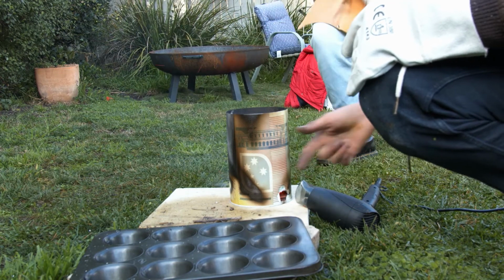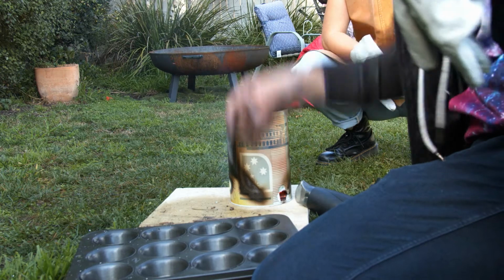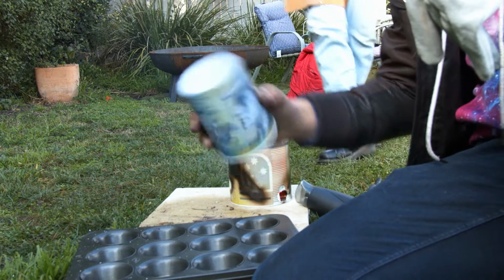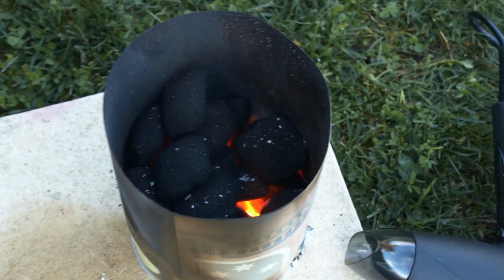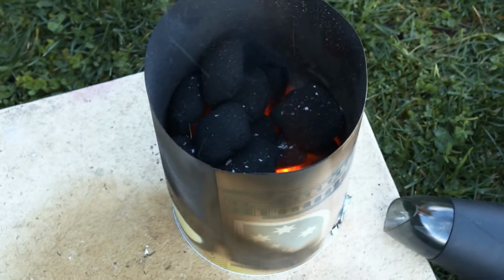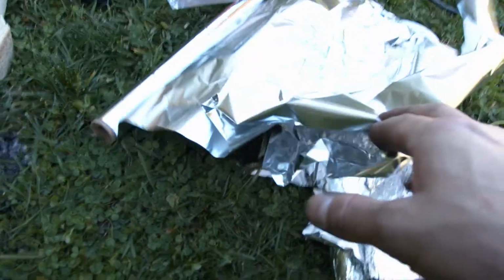And we're just heating it up now with these bricks here, charcoal bricks, to get nice and hot, then we'll put this in and start melting some aluminium. Yeah, it's getting real nice and warm in there now. I want to try to make a nice kind of platform almost out of the bricks for the crucible to sit on.